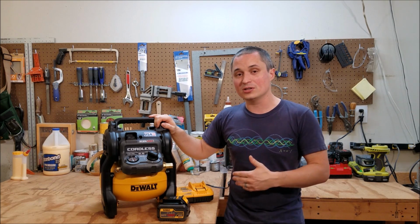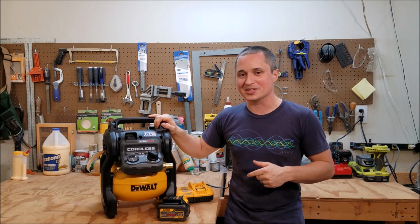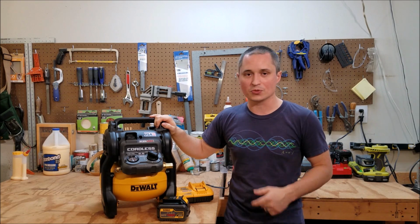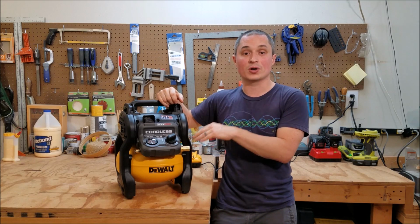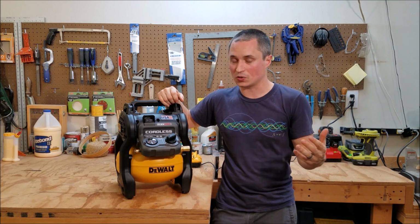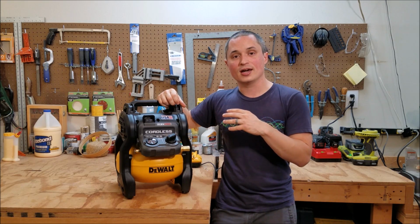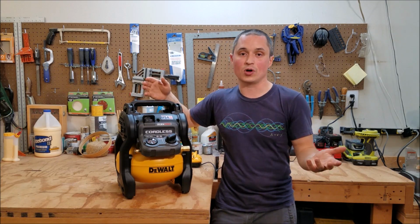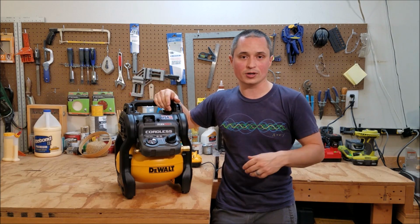I was going at a pretty good pace, but I know a lot of you pros out there would probably be able to outwork me pretty easily, and you could probably outrun this with a framing nailer if you really gave it a run for its money. One last note: in all my testing, I was using a 100-foot air hose because that's what I had lying around. So you might have a little bit of a difference in how many shots you get out of it before it cycles because of that extra air volume. If you're using a shorter hose, you have a little bit less air volume in the hose.